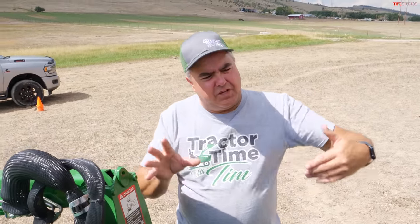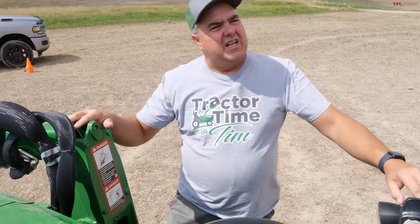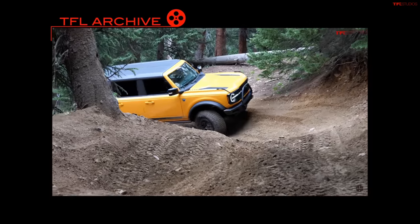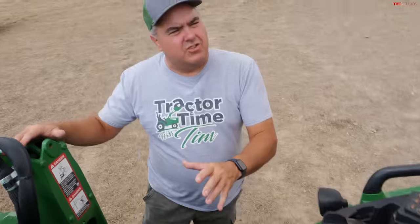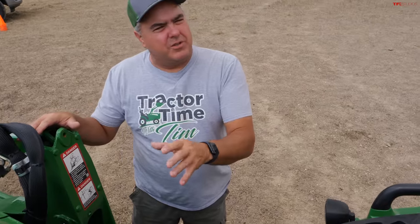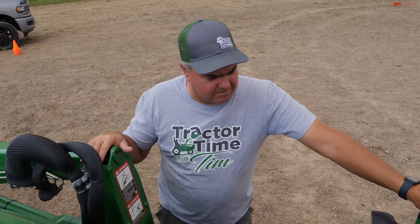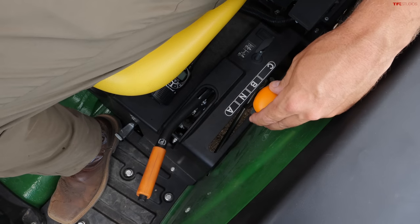Why are separate brakes done that way? It allows more fine control over steering. If you get one wheel spinning you might want to stop it, or you might want to turn a little shorter — you can actually skid your front wheels around almost like a tank, or like a skid steer loader. The Ford Bronco has a turn-assist feature too, and Land Cruisers have something similar. From the 2 series on up, you get those independent brakes — it gives you a little more control of your driving experience.